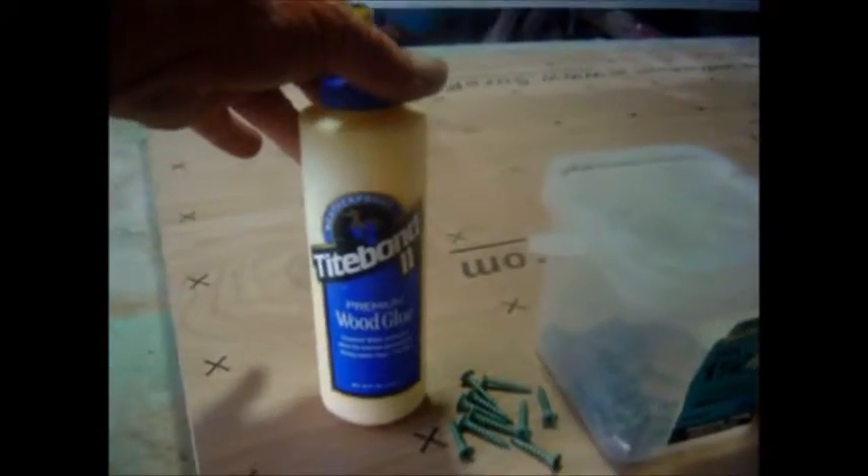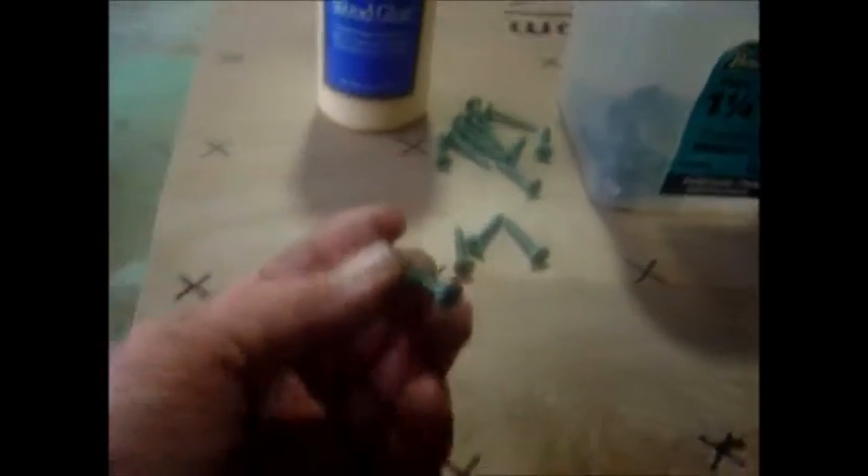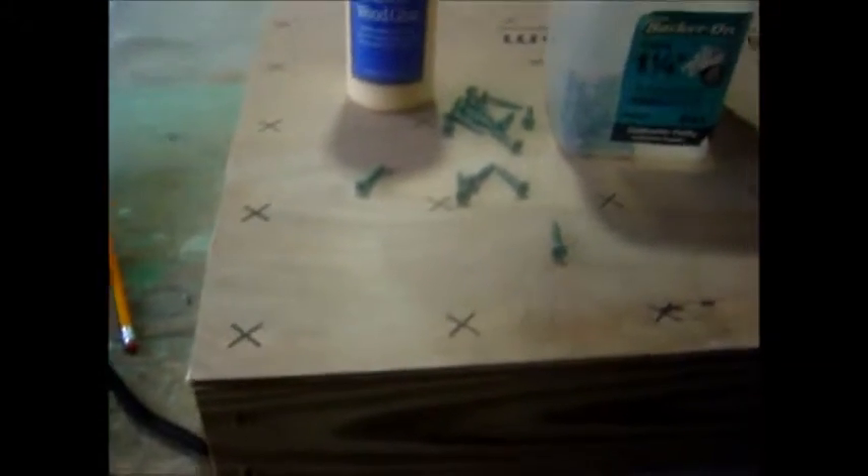I want to touch base on the glue — I'm using just a regular premium wood glue and corrosion-resistant screws. These are coated screws for backer board, corrosion resistant, 1-1/4 inch, and that'll fasten this to the treated lumber. Make sure your screw heads are flush — square this up as good as you can, all screw heads flush with the wood or below — then we'll be gluing the foam to this right here.